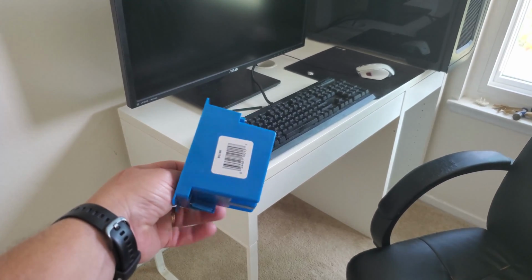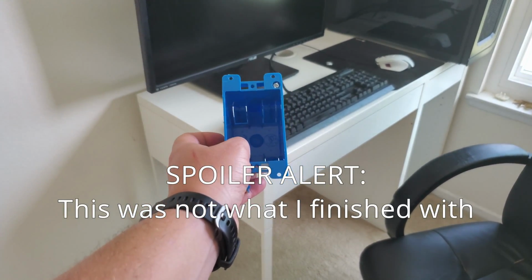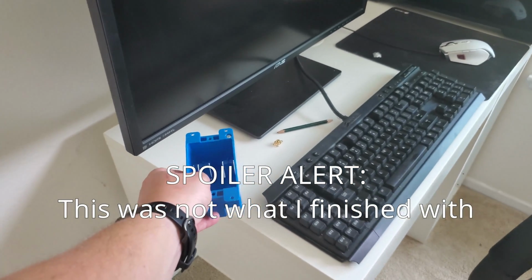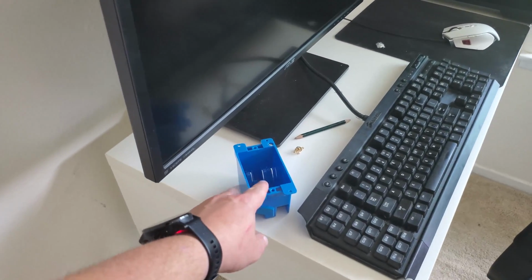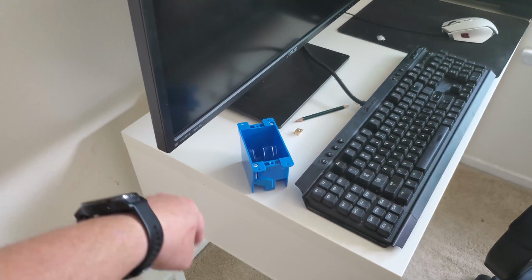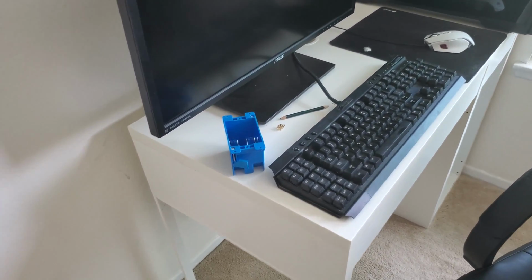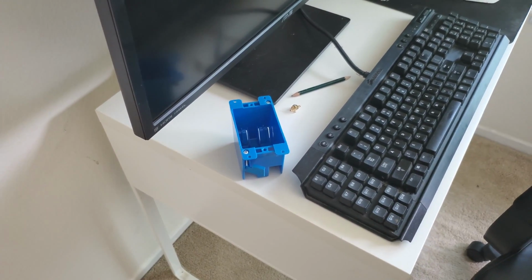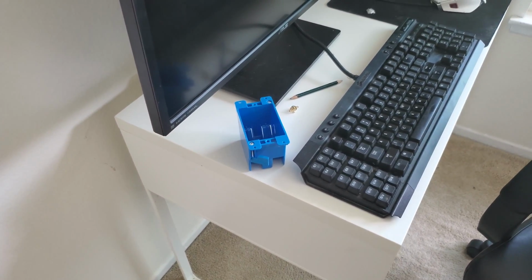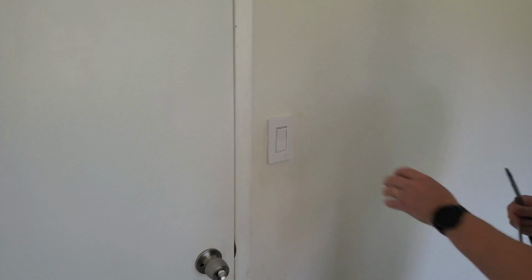And he recommended that I use this retrofit box instead of doing the 2 gang box that I showed you yesterday. And so the only drawback to this is I'm going to have to bring power from this one over to the new box, and that's not going to be that difficult. But besides that, the good thing is I'm not going to have to do any additional drywall. Just make sure I cut it real tight. All right, so I'm going to go ahead and set you guys up on the tripod, start cutting into the wall. I've already secured the power. We'll go ahead and send it.